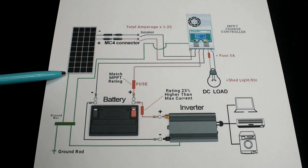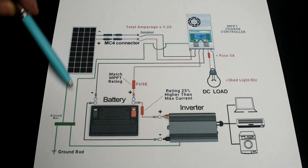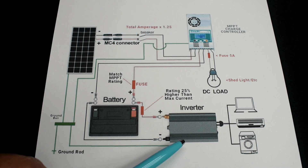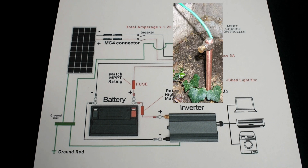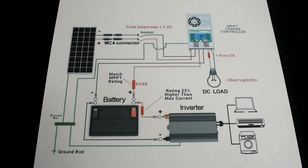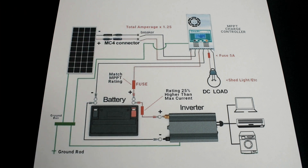You're going to run a ground wire from the solar panels to a ground bus. Take the housing of the charge controller, connect a wire to it, and run that to the ground bus. Take the housing of the inverter and tie that to the ground bus as well, and then run a wire from the ground bus to your ground rod. You can pick up a ground rod at Home Depot, Lowe's, or other home improvement stores. For wire sizing on the grounds, I would go with a number 8 from the panels, number 10 from the inverter and charge controller, and number 8 going from the ground bus to the ground rod.